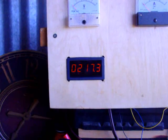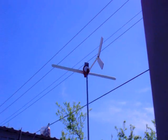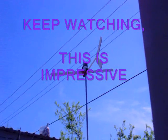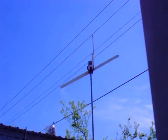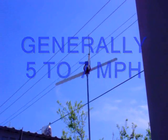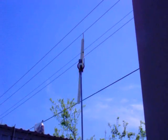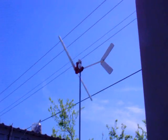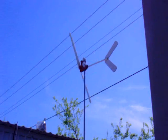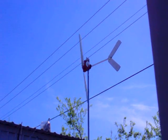This digital RPM meter is a lifesaver — it's worth its weight in gold as far as I'm concerned. And we got the amp meter and the volt meter here. Let's see if it'll start up on its own with a little more wind. This is going pretty slow at 5 to 7 mph winds. Watching it get to cut-in speed is pretty good. Starting to spin — all of a sudden it'll accelerate really fast. That's when it gets lift. One, two, three... now starting to speed up pretty quick. Looking at 150, 190, 202, 191 RPM — jumping around.